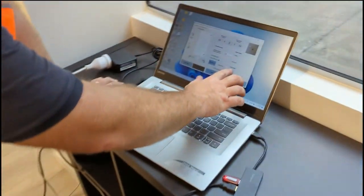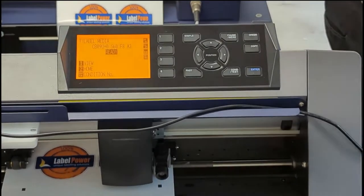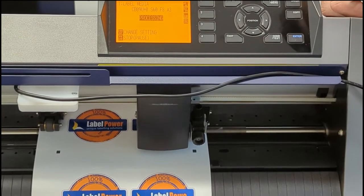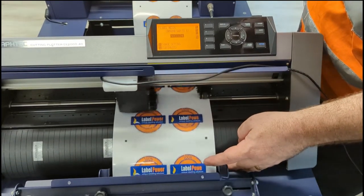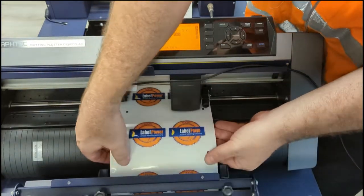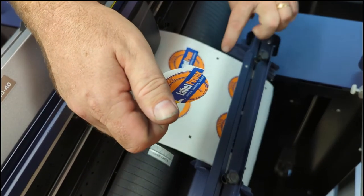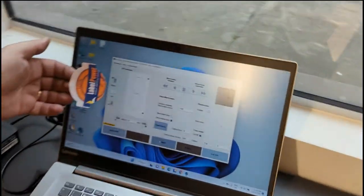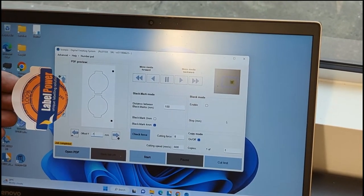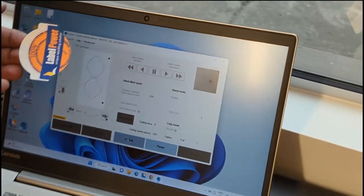In the software, there's a copy mode on and off. Turn that on, copy is one, then hit start. The first machine will do a test. I have to help feed it in as it does the first cut, then grab the first one off. The black marks are at the front. Taking it to QC, we need to change the line offset — go negative ten, still doing one of one, black marks still up there, hit start, and we'll see if it aligns a little bit better.